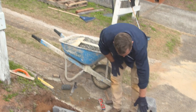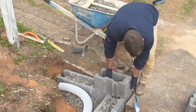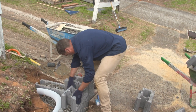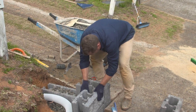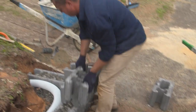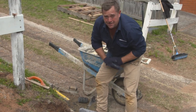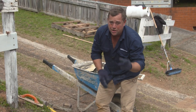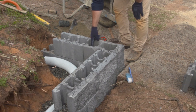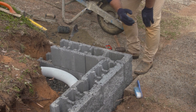Now for my second course, I've got my right hand corner — the little lugs have been knocked off and we're ready to go. And it's as simple as that. You can repeat the process. There's nothing more to learn except infill, backfill. As you go up with your wall, infill first, backfill behind it later. The infill will hold it in place and the backfill will help you with the drainage.